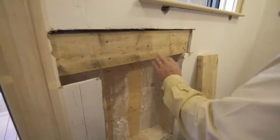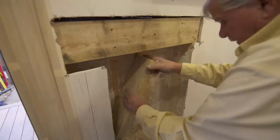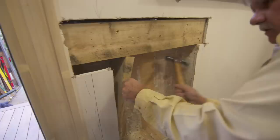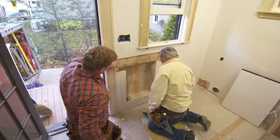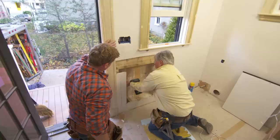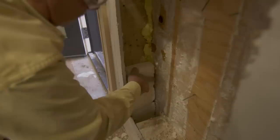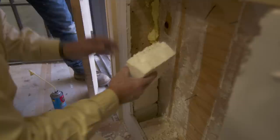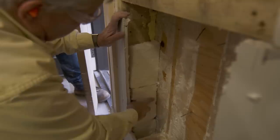I've cut this stud off right here and put the header on top of that stud. Now we have to support this side over here, so we're going to slip a jack into the wall and slide it against the king stud. This will push our header up tight to the structure above. Now I'll just screw that to the king stud, and this new header will carry the load above. I can salvage the old insulation — I cut it so I can just compress this jack against it and fill the void with expanding foam.